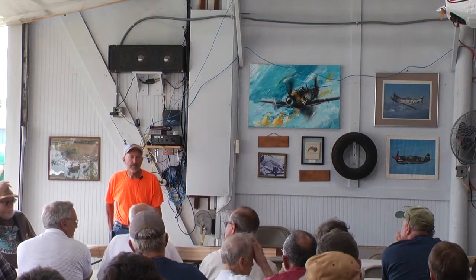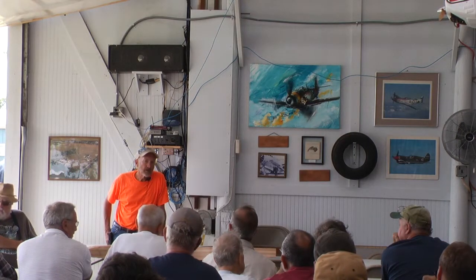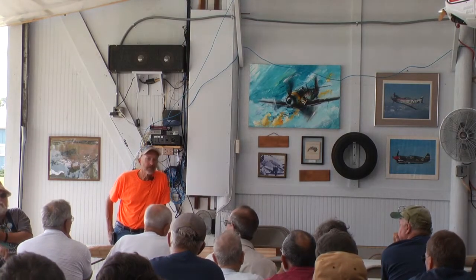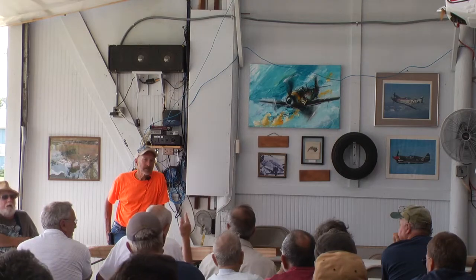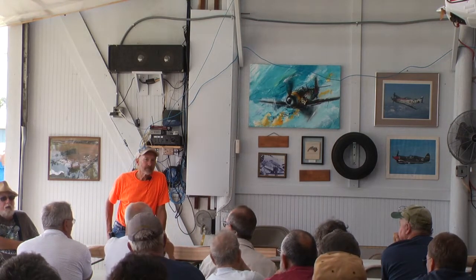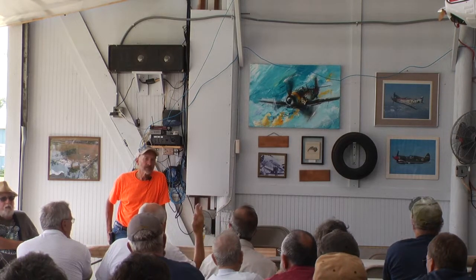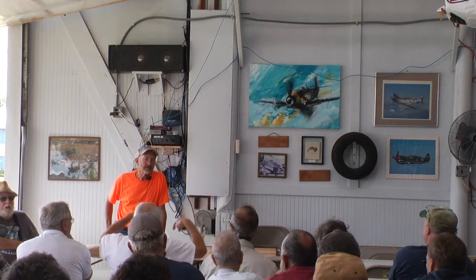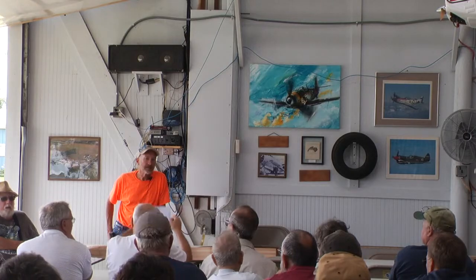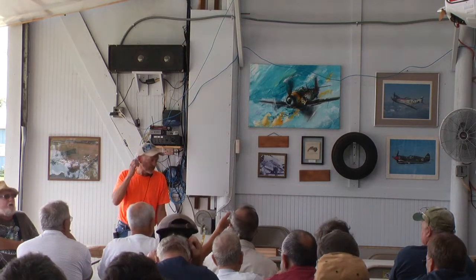I spoke to you a couple of times also. Instead of using clamps, I made up a jig. I was able to apply pressure. I had a bar that went across at each, let's say, every 6 inches, with all threaded rod. So I put the bar across the all threaded rod and applied pressure throughout. That's probably a better way to do it.